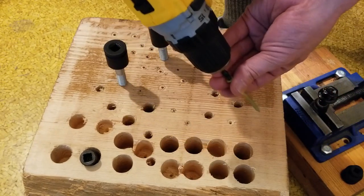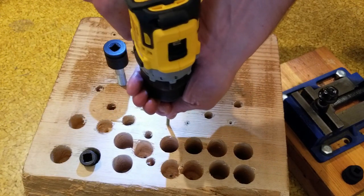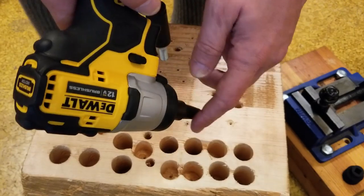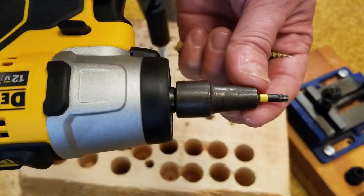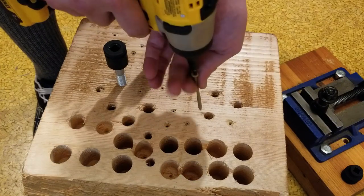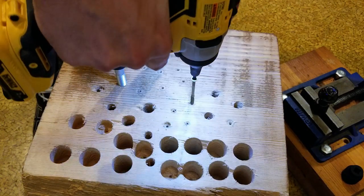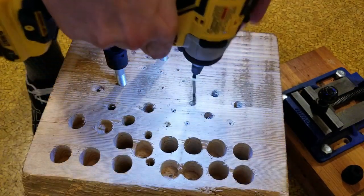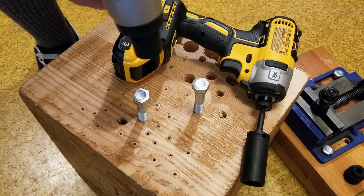Quick note: somebody asked about the 12-volt brushless drill — yes, it will do three-inch deck screws in second gear, no problem. I have these nice little adapters — I particularly like this Apex adapter because it has a longer nose for high access but allows me to use short bits, which are more rigid and give a bit more power delivery. This thing works great for driving screws even though it's the quote-unquote impact wrench, and the gearbox does sound pretty nice.